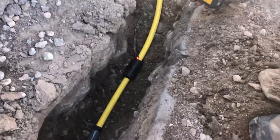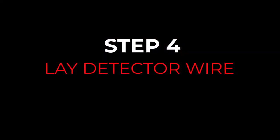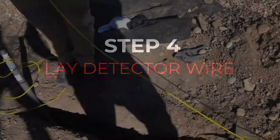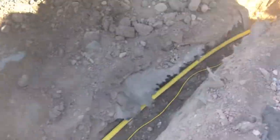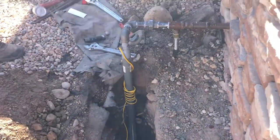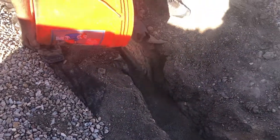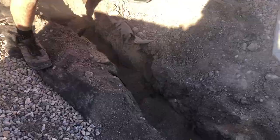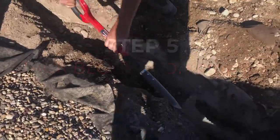One more leak test — we've got our little sniffer to see if there are any leaks. One more important thing before you bury it: we've got our detector wire, which will allow you to check to see where the gas line actually is. We are also adding some sand before we throw in the regular dirt, as the sand will help protect the gas line.